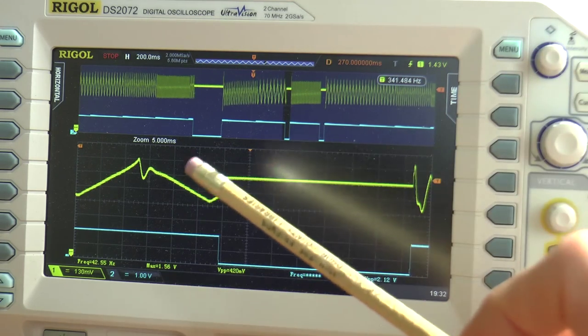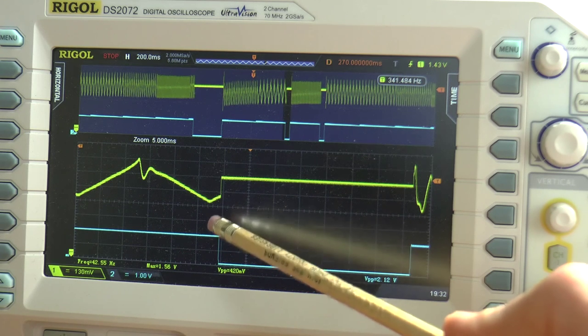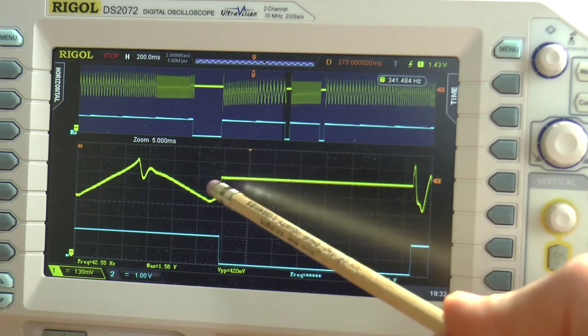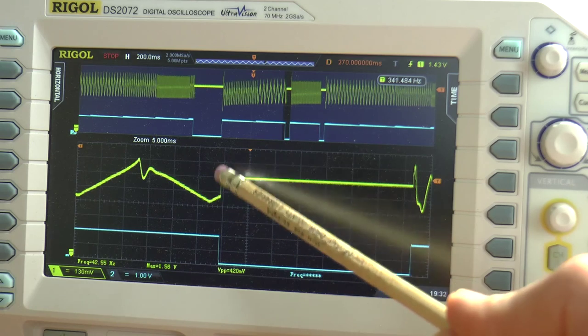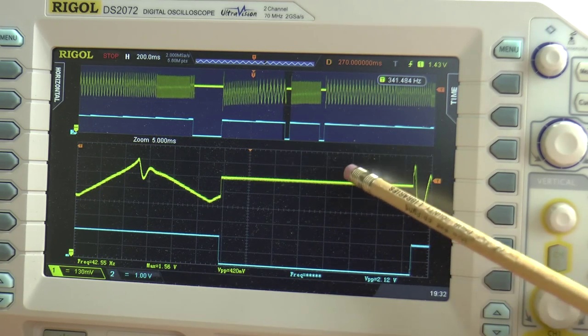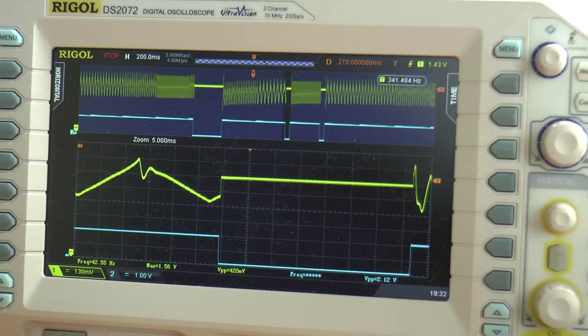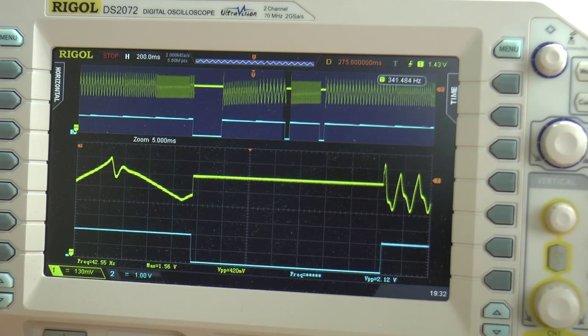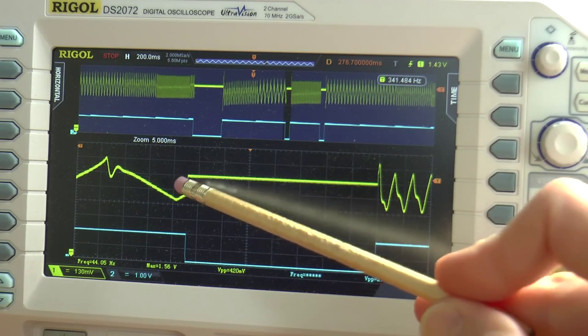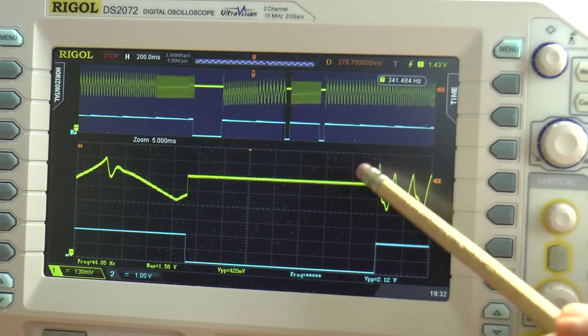Now you'll see right away that where the envelope generator switches in volume, it's just chopping the waveform. Basically, it's throwing the waveform from whatever amplitude it's at to zero, the center line. But it's not doing it at a zero crossing of the waveform, and same again on that end. And each of those places where that happens would cause a pop or a click that you would hear.